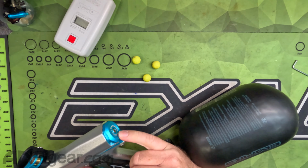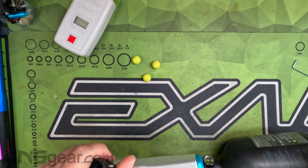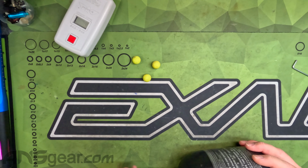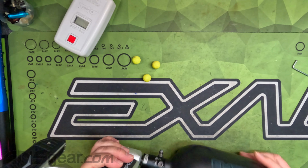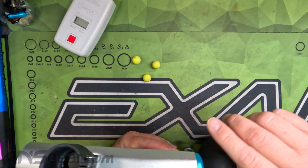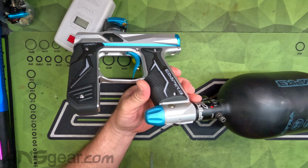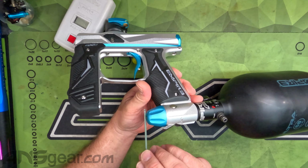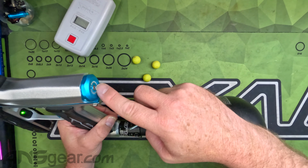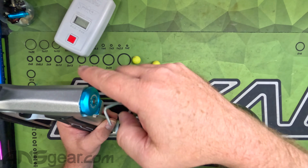And I can see that they tried to turn it up, because if I look at the velocity adjustment on the back, the velocity adjustment is almost flush with the back. And to have velocity be at about 270 or so, typically, this is not always a fact, this is where I start with guns right here, typically flush right here with your reg adjustment, and then your velocity adjustment on the back right here should be about 3/4 of a turn out from all the way in.